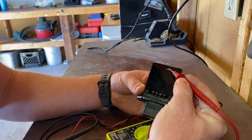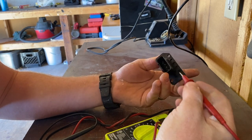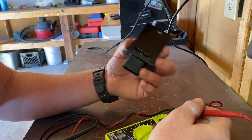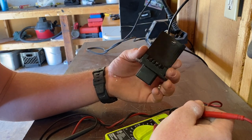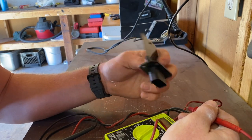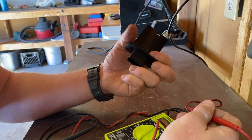So I took a soldering iron and just tapped it on this side here, remelted that solder to this line a little bit, and sure enough, she started working again. Not sure how long this part is going to last, but this is a part that's under warranty and can only ever be swapped out for more parts on warranty. I can't actually return it, so I might as well run this one until it goes bad, and then we'll get a better quality part next time.